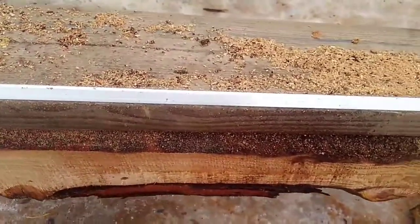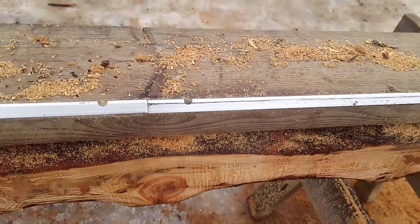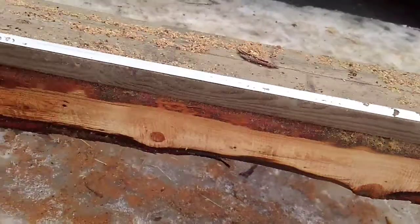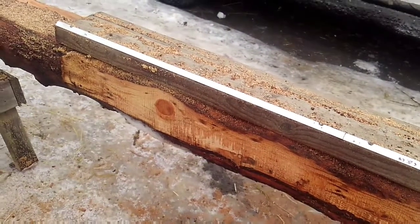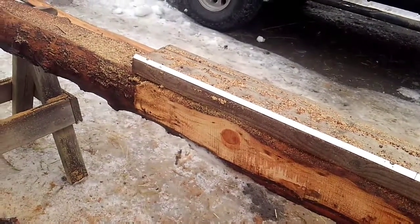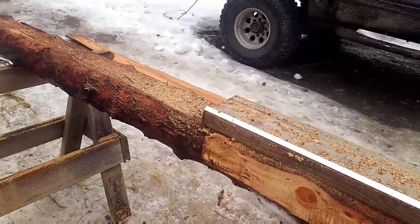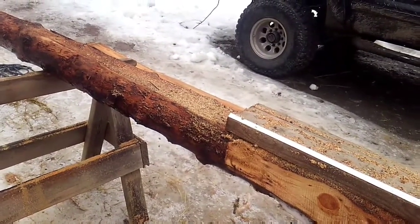And here's the V-track. You can see it just has two screws on each end. They're 2 foot long, and when you buy the mini mill, it comes with 12 feet of it. And I am finding that with a 2x6, I can just slide this 2x6 down. I just line it up with where my previous cut is right there. So I'll give myself a couple feet and I can line myself up fairly well and keep a straight line. Or if I have a longer log, then what I can actually do is just smooth off the top, lay my 2x6 down, and then I can just extend the 2x6 down and cut a longer beam if I so desire.